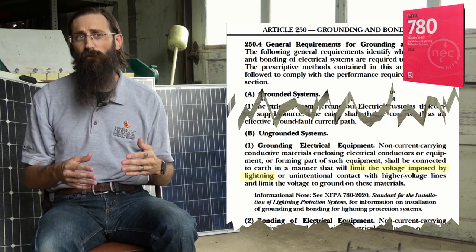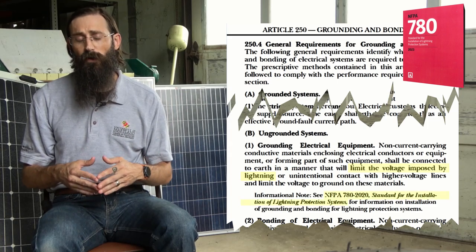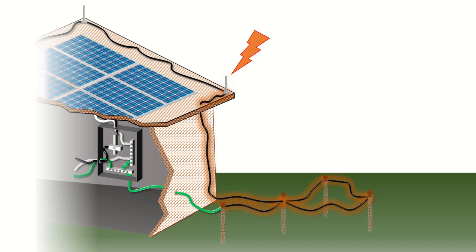Lightning protection requirements are addressed more extensively in the National Fire Protection Association's NFPA 780, the standard for the installation of lightning protection systems. Adequate lightning protection for a photovoltaic array will capture the energy from a lightning strike through a low impedance network of air terminals or lightning rods, and then transfer that energy into a grounding electrode system. Any surges induced by a direct or indirect lightning strike would be conducted to the ground, safely away from the building and equipment. While a lightning grounding electrode system is bonded to the grounding electrode system for the electrical service, it would typically not be bonded to the grounded conductor of the DC system, as that would introduce more than one ground connection for the DC system.